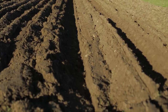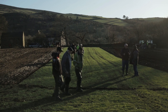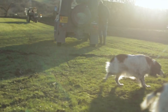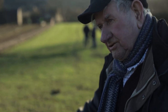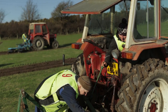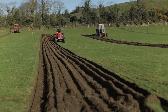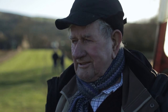The main thing, if you're going to do Manx style, is to get the plough ploughing nice and even first — without any knives or backs. Get that ploughing nice and even, and then you can put your backs on and cut your slices. Your plough has got to be right first. It's like an artist — you've got to have the gift for it. Patience. Take your time. Just done right.